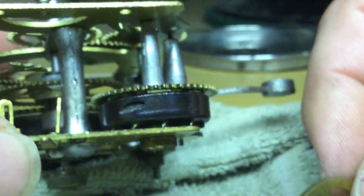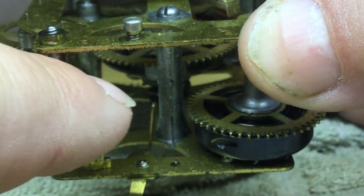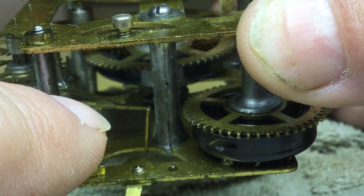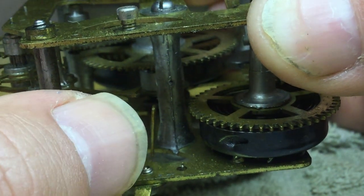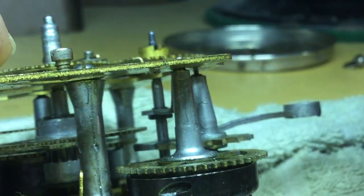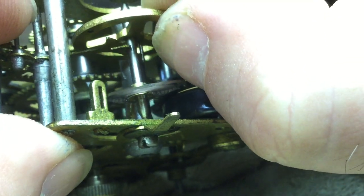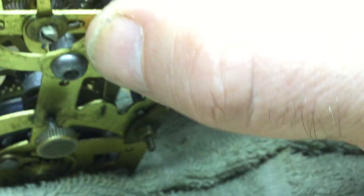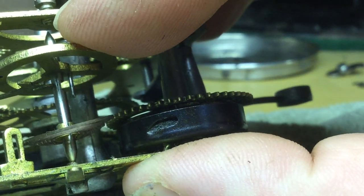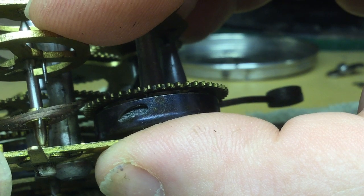Take the movement and get ready — this is the lever right here, and the lever has a fork. On either side of the fork slot are the safety horns, and that keeps the lever from moving out of position when the clock is running. We will take the balance wheel assembly and put it back in, making sure that with the impulse pin not pointing at the lever, the lever is centered on the balance staff over one of the safety horns.